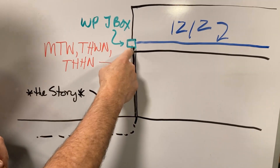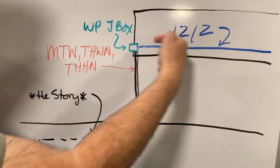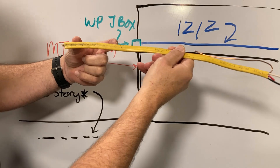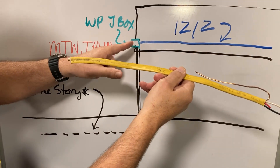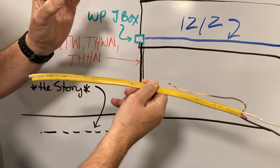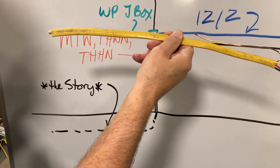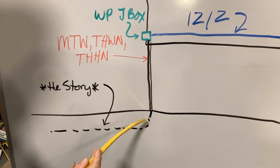The last thing is protection. This happens all the time here in Texas — everything is brick. So you come out with Romex through brick, passing through that three-and-a-half inch deep jagged stone or brick. You have to protect it, which means the back of this j-box should have a connector of some kind and a sheath — a lot of times it's Carlon non-metallic flexible — something that protects the wiring going through brick or stone, because it does get torn up like crazy.